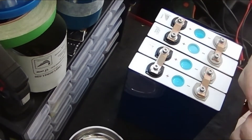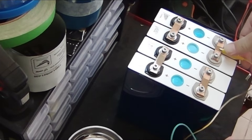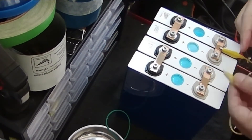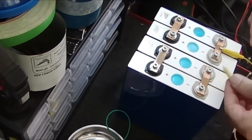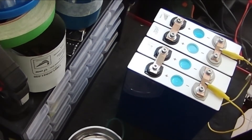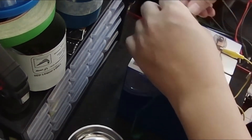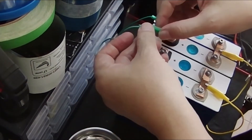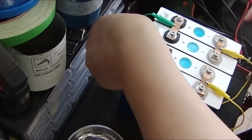I aligned and connected the batteries in parallel. As I do not have extra copper plate, I am using crocodile clip wires to connect the batteries. The thin wire should be sufficient. It is always important to note the potential amps going through a wire when connecting between devices or batteries, because over-amping will burn the wire and cause fire.